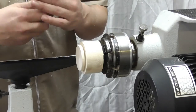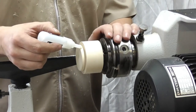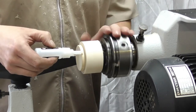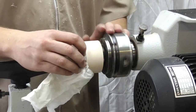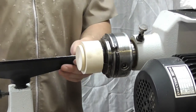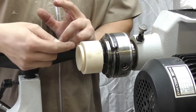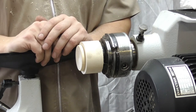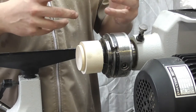I'm going to use some thin cyanoacrylate glue again — I use Bond Lock but whatever you normally use. Definitely use the thin because it soaks into the timber. We'll get some tissue on there just to take the surface amount off and activate it. That's ready for cutting the thread. I'm not actually going to complete the whole box and hollow out — we're just going to make the two parts thread together just to show you how it all works.